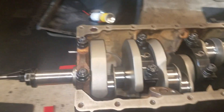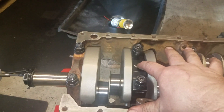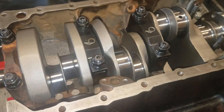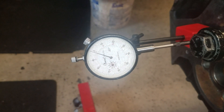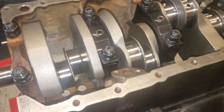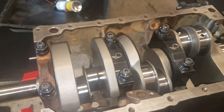After that, you want to snug up these caps. I just want to snug them and then I'm gonna do it again. Alright the caps are snug. And that's a dramatic change. So that tells me my cap is not centered on the thrust bearing down low. So I'm going to smack it again and center it up.